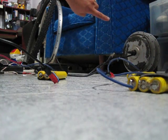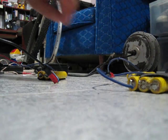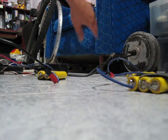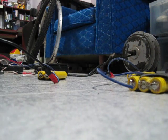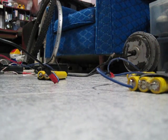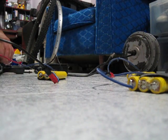And also fixed some of the windings. To be honest, the windings were actually damaged because there was a piece of solder in the motor, so while it rotated it scuffed the winding. I separated the little wires because they were touching on one of the phases and it wasn't allowing the motor to work properly. I managed to get it to work by fixing the wires and topped off the scuffed windings with some epoxy. So now everything works good and I'm happy with it.